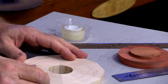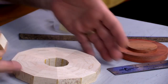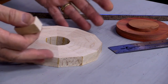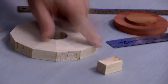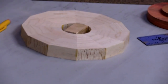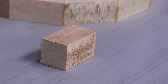There are a couple of different ways you can work that out. I've watched YouTube videos — saw one guy that used a dial indicator on a rotating table, but that's expensive equipment and I'll never get the hang of that. I came up with a better way. I take just a scrap block of wood that's about the same thickness as this, cut it so it fits inside the hole, and secure everything down with a little piece of double-sided tape.